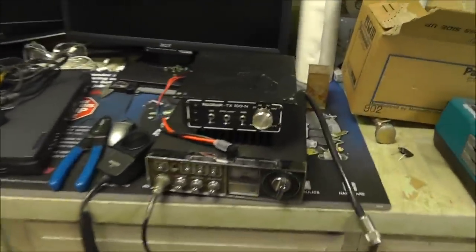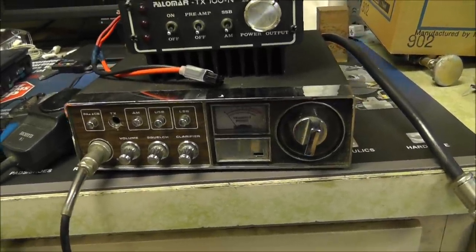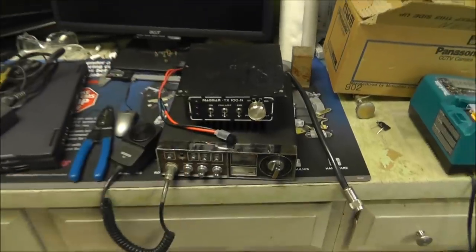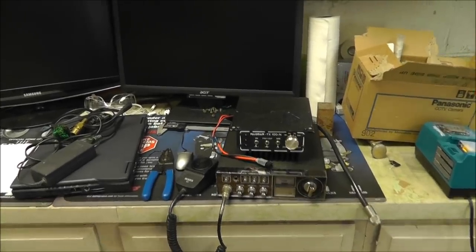Real quickly, the RF versus radioactive material in this device. I just wanted to inform you really quickly. I did get the RF amplifier, 100 watts, selectable, 25, 50, 75, and 100. And the CB here to run it, channel 12, what is that, 27.125 megahertz, I believe. One of my friends at work, he's a radio guy, and he luckily had some of this stuff. We traded for some things, so I'm lucky enough to have that. Zero fossil fuel, he's the same guy I was talking to you about. And so there's that. I think that's it on parts, pieces, things, and stuff.